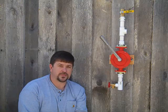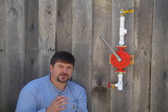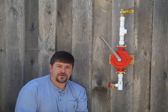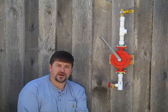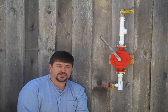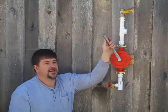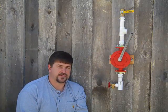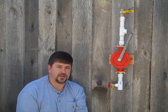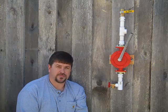If you have existing plumbing, I'm going to show you how you can tie it in. Picture being in a very cold climate but you have a basement with a plumbing system already set up with your well, spring, or whatever you have. When the power goes out, you just go downstairs, pump this baby, and you can take a shower. This is a really good pump - six gallons a minute, making about 38 PSI in your bladder tank, so you can distribute water throughout the house without a problem.